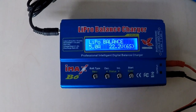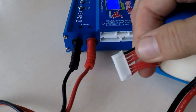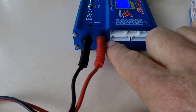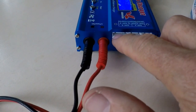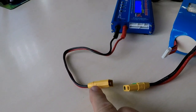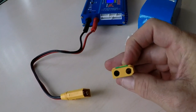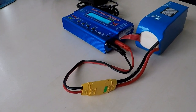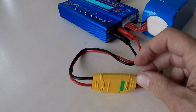So this is now all set up to charge the battery — we now need to plug the battery in. To plug the battery in we need to plug the balance lead, which is the seven-wire lead, into the correct port, which is this big one here. Because we're using the 6S or 6-cell battery we use the large port. If we're using a smaller 4-cell battery then we'd use this smaller port — so you need to choose the correct port for your battery. Then we need to connect the battery to the lead from the charger. Again make sure the polarity is the right way around, red to red, black to black. The connections are unidirectional so they can only go in one way. So we have now plugged in the batteries — we've got our battery lead, battery balance lead going in, and our battery charging lead connected correctly.